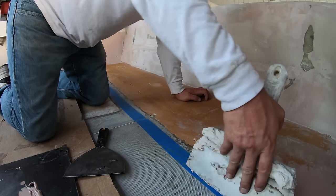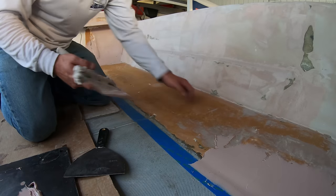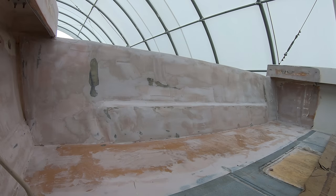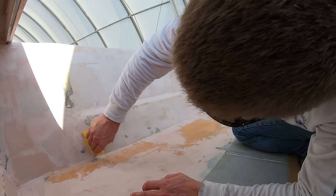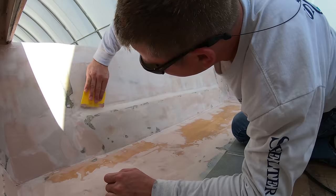For the transition into the old non-skid floor, I just put a piece of tape in a straight line across the deck and then filled that in with our filler. We also sanded down the white sections where the old boxes covered up the unfinished glass and then filled that in as well. Once we get all of our surfaces pretty smooth, we want to stop using the metal knives and start using a small plastic scraper.